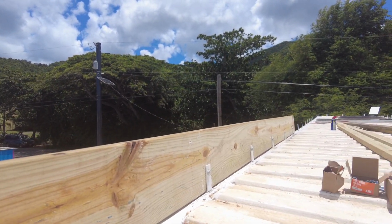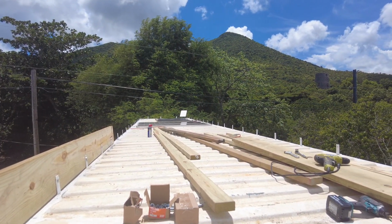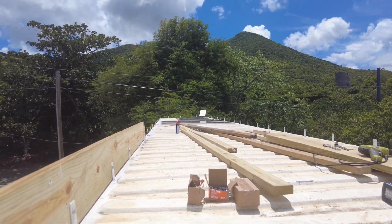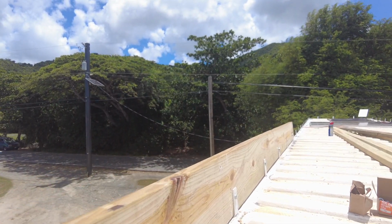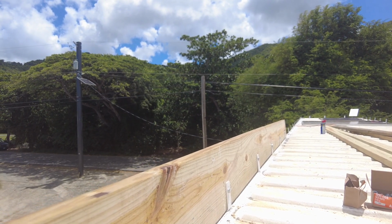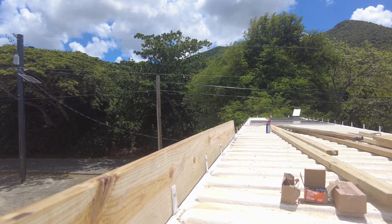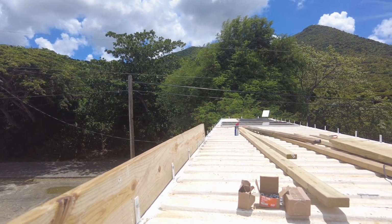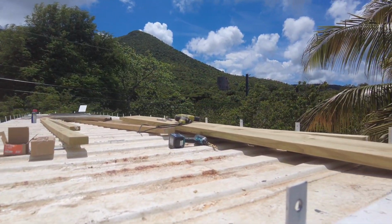I'm going to have the lateral wood that's going to be 2x4 at an angle. So the idea is to collect the water on the spread net side, on this side here, on the east side. The water will go all the way to the back with an angle, obviously with a gutter, and then I will collect the water this way. So yep, that's it. Let's keep going.